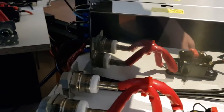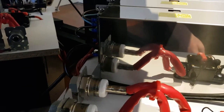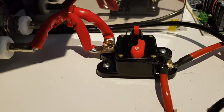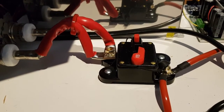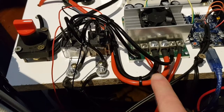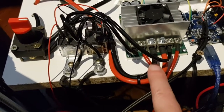The output from the power supplies is set at 26 volts. The output from the batteries is 25.3 volts. Taking into account the 0.6 volt drop across the diodes, it means that the power supplies are a few hundred millivolts higher than the battery and should keep them at the stated 25.3 volts. The Sabertooth 2x60 inputs take these 8 gauge wires coming from the power supply with the batteries in parallel.